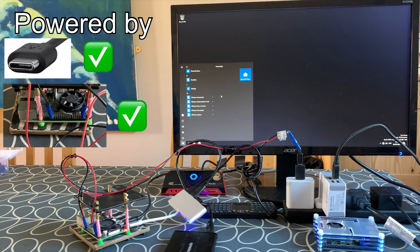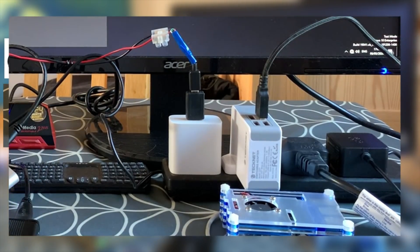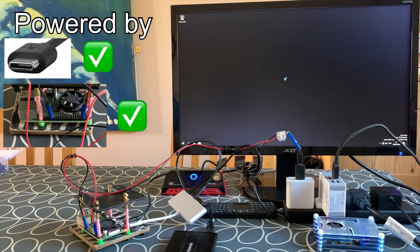In theory from everything I've read, the lightning bolt should come up less now. This is only using a 1.5A adapter, so I could use a higher one — the four-port adapter next to it has 2.4A. I'm going to experiment, but I thought people would want to see a Raspberry Pi given more power; a lot of makers do this for motors and various different builds. Having seen that on Marsan's blog, I knew the bottleneck was power. The lightning bolt hasn't come up, so even with this it's probably just enough.